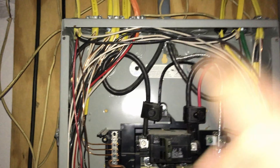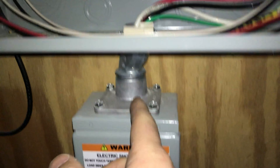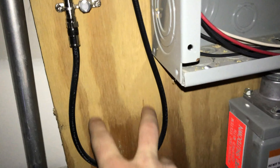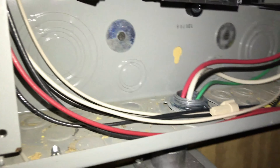Let's unscrew the front of this panel. All right, front panel is off. Now I have to look - these are my inbounds from the pole, don't touch those obviously, and then the solar ones are coming straight up here. I think to hook to those the Sense as well, I will need to put a hole through this panel probably here and here. I need two spare breaker spaces and I think I was told I have one.